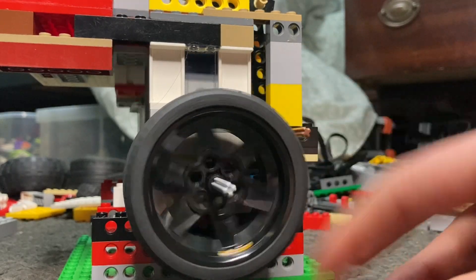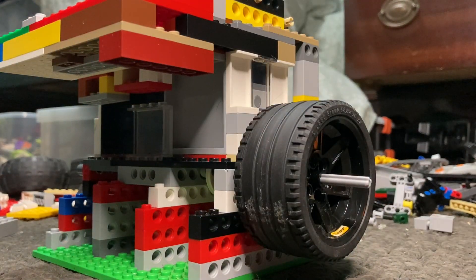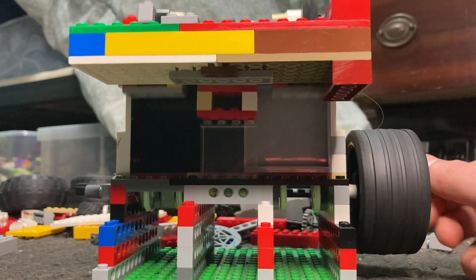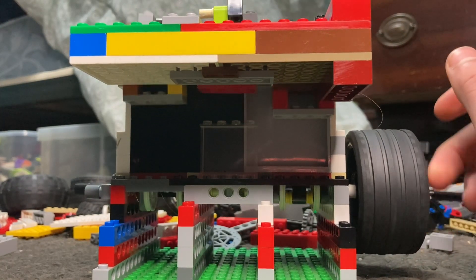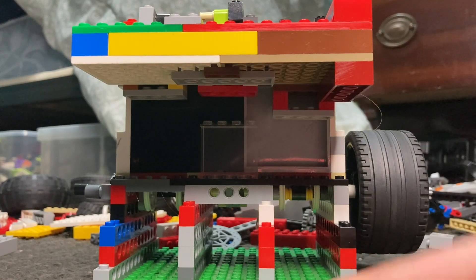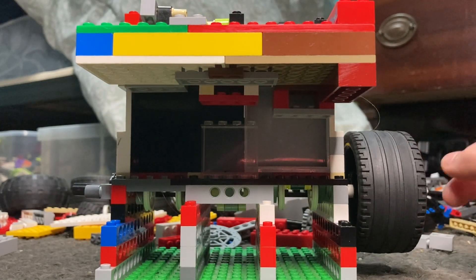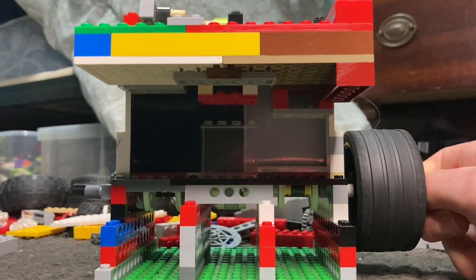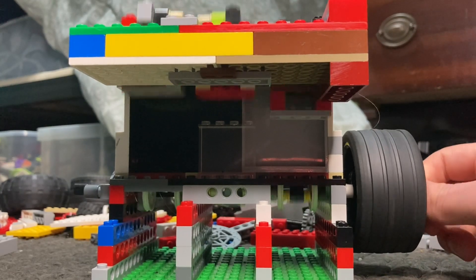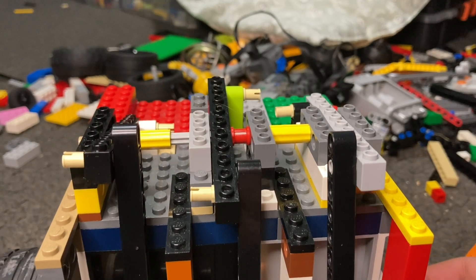Moving to this side, you have a flywheel and manifold, and you can see the valves — I'll get into those in a second. The manifold is right here; the vacuum connection goes on right here very simply. If we turn it this way, you'll see the valves dip down quite a bit. That's because it uses a three-stud-long valve stroke, since the 1.5 crank arms I normally use for the valve train don't have the ability to achieve that 120-degree offset. They go in that one-two-three pattern, and at the top you can see the push arms and rockers for the actual valves.